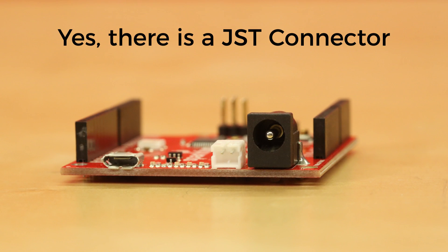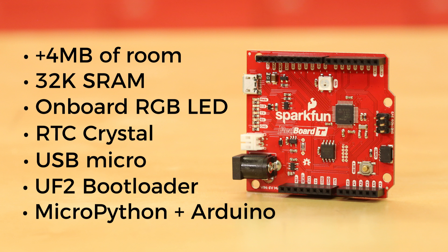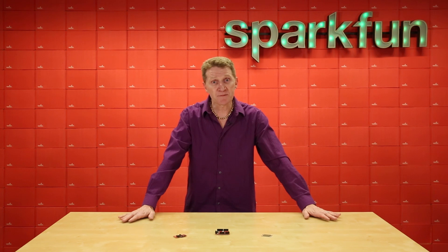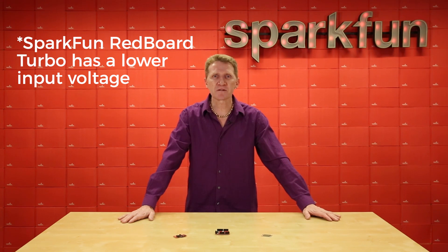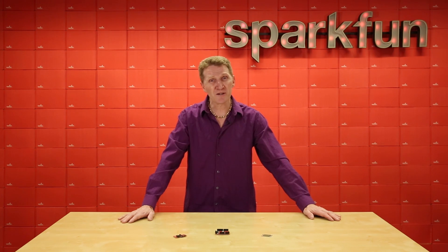You can also power this board through the barrel jack or the JST connector. There's a JST connector to allow you to use LiPo batteries, along with onboard current-configurable charging circuitry. And finally, with the UF2 bootloader, this board will show up on your computer as a USB mass storage device without any drivers necessary. So you can run MicroPython scripts, but you can also run your Arduino scripts. One thing to be aware of: the SparkFun RedBoard Turbo has a lower input voltage than most other Arduino dev boards, so you can't just grab your power supply from your last RedBoard and plug it into this, or you'll be terribly disappointed waiting for your new RedBoard to arrive.